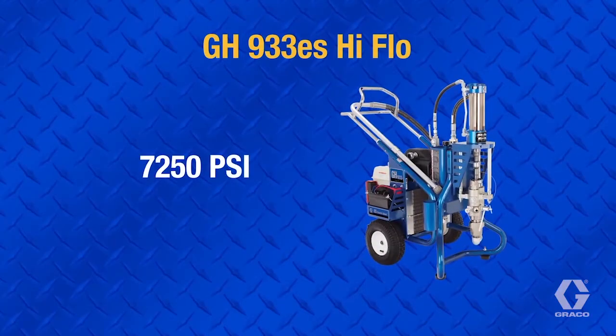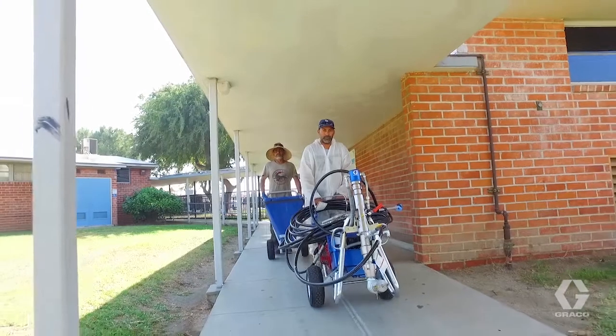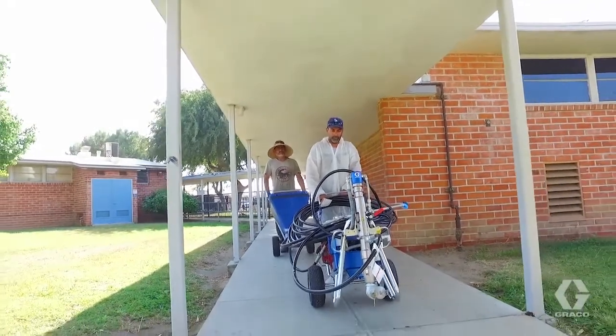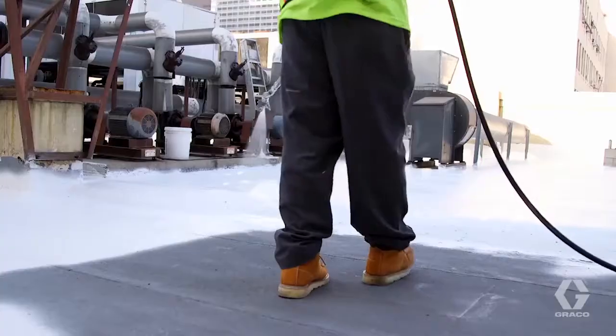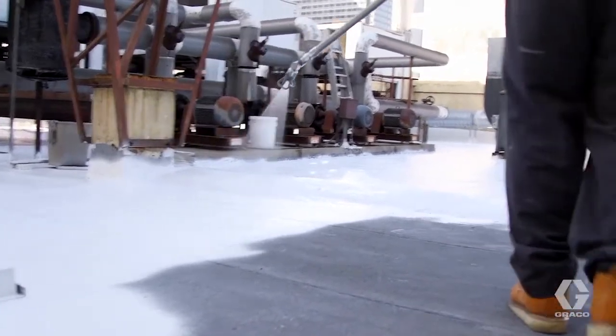Choose a high output sprayer that allows for extended hose lengths, yet still allows for adequate pressure at the gun to atomize in varying temperatures and different formulations. Smaller machines can be used on medium to small roofs, but still require moderate hose lengths and utilize smaller diameter hoses for easier maneuverability. Use of filters with silicone is not recommended due to the reduction of flow.